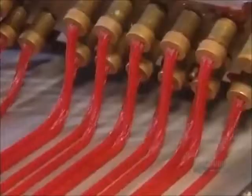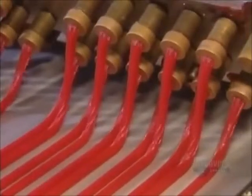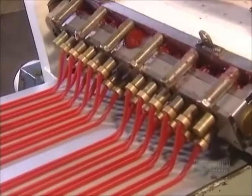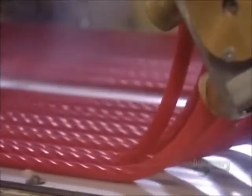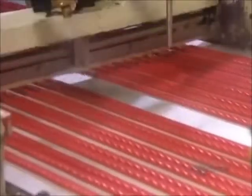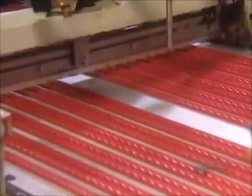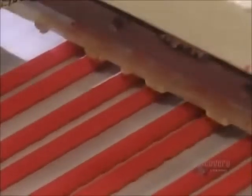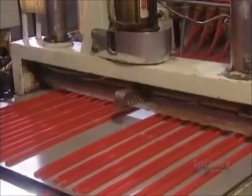They cool it down, then put it through extruders. The extruders work like icing nozzles, shaping the paste into a design such as the twirls we see here. A water-lubricated knife slices the continuous strips into 18 and 21 centimeter lengths. The water also rinses off any licorice buildup on the blade.